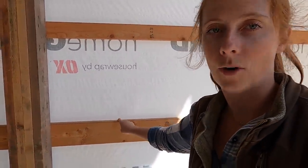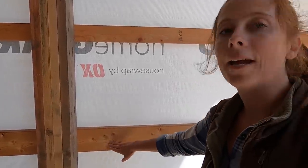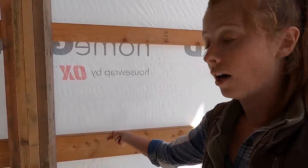I am super excited for the wainscoting because we did something a little special. Quite a few of you had asked why one of our wall girts is a two-by-six instead of a two-by-four. That is because this is what the wainscoting is going to mount to. We need room for our wall panels, the trim, and our upper wall panels to all meet on this one connection.